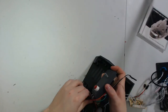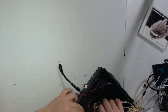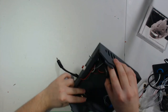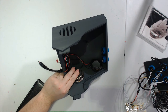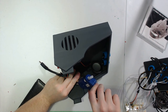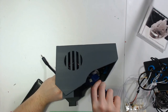Now that our panel is finished being wired, we can slide it into position. Put our two speakers inside the cabinet and it should just drop right into that groove. These aren't going to be tight enough to friction fit, so get them positioned and put a little bead of hot glue around them — that should hold them in place. You may find it easier to do one at a time, flipping the cabinet on its side so gravity holds it. When you glue your speakers, be careful not to get any glue into the actual cones as that will affect the sound. Use enough to get it secured — it's a less-is-more situation because the glue is hot enough to weaken your PLA.